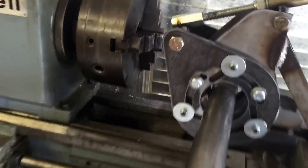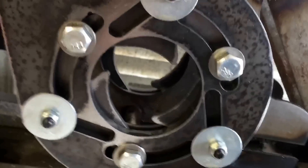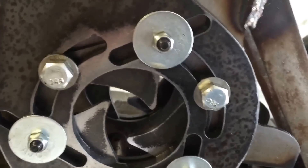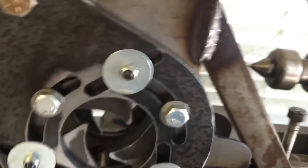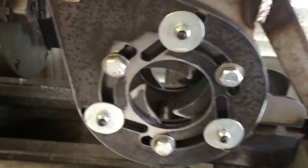Open it up, pipe out — you can see I made a nice little fish mouth with that earlier. Spin this wheel up here and see the jaws coming in closer and closer together, gripping the pipe evenly to hold it into the center. Spin it the other direction and open it up.